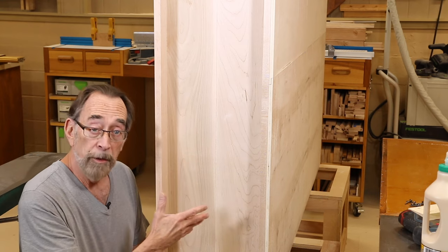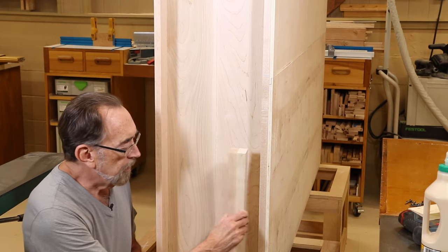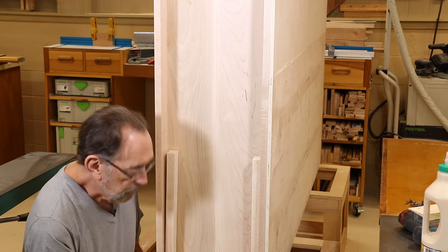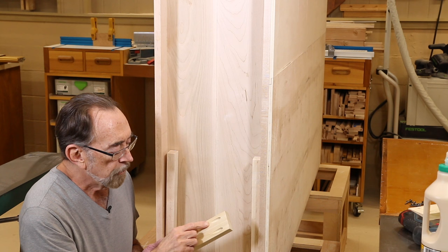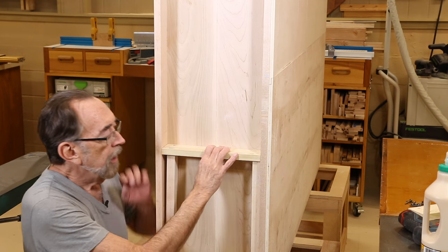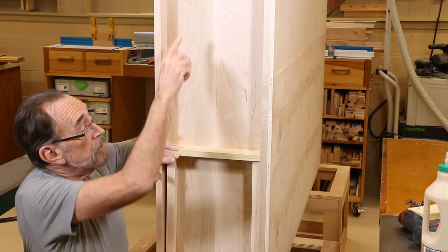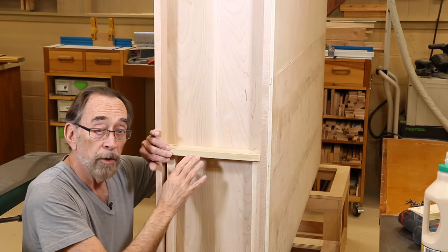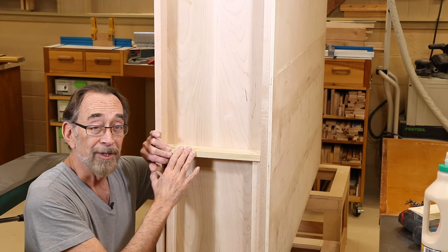The perimeter bracing for the base is now glued in and the glue has set. It's time to put in the two cross braces. I've cut a couple of same-length spacers to put in here so I can rest my cross brace on top, making sure it's perfectly level. I've also cut pocket holes in the ends of the cross braces — that way I can put some glue on and use the pocket holes to secure it without needing clamps. I'll use those same spacers for the second brace on the other side. Once these two cross braces are in and the glue has set, I'll be ready to stand this bookcase up and get to work on the face frame.